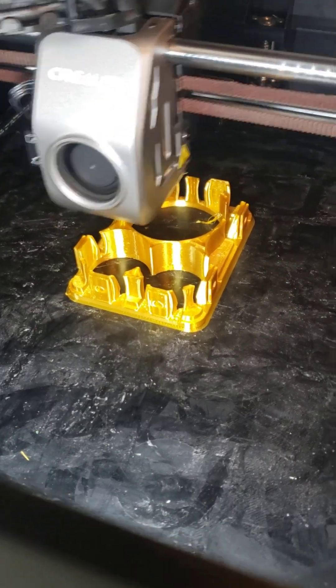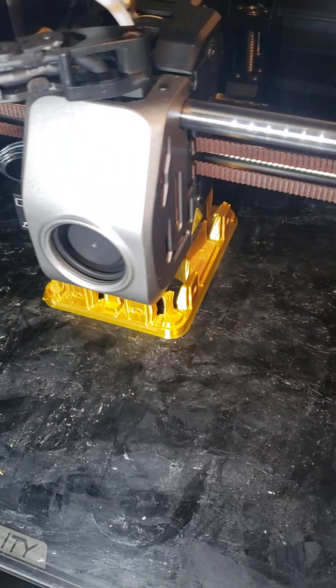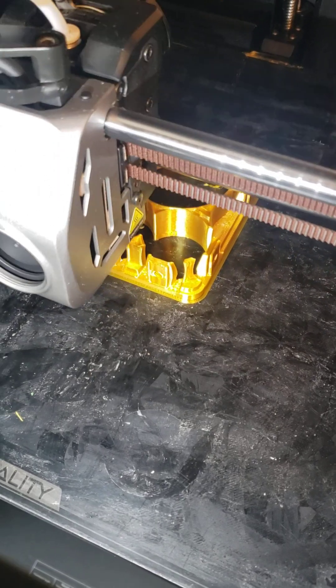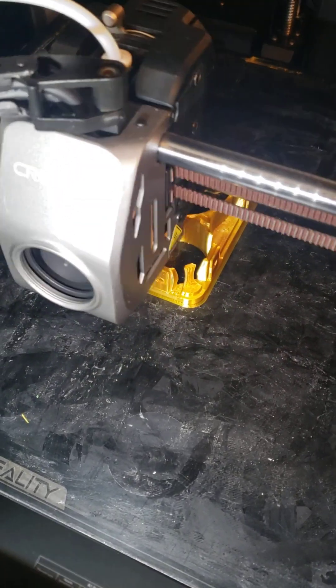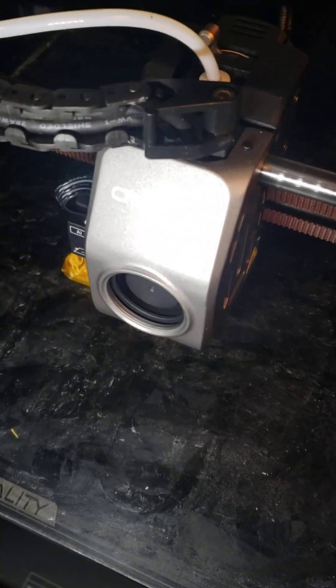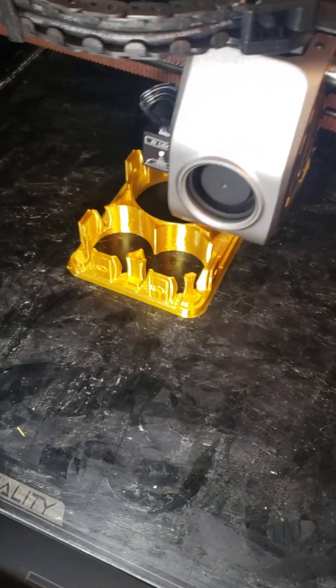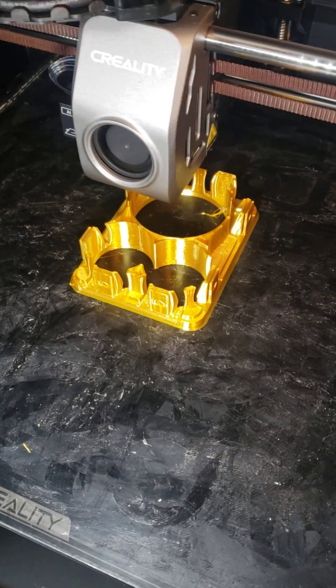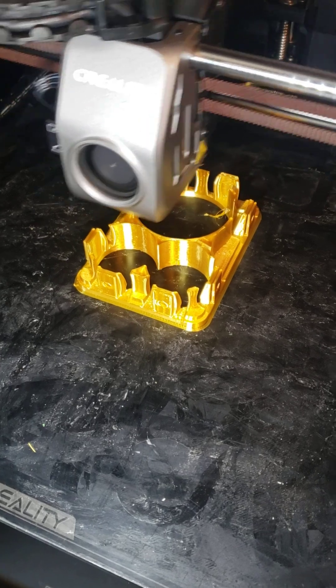I just want to summarize my video from yesterday. Basically my K1 Max printer's bed went way out of alignment — it evidently hadn't been gradually doing that. I aligned it and ultimately it turned out that the belts were loose, so I popped the bottom cover off, which was quite easy. It looks like right from the factory the tensioner was stuck and didn't tension properly.